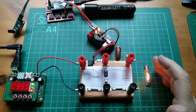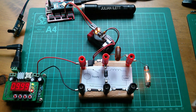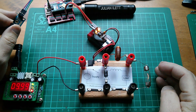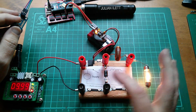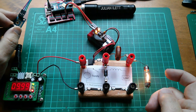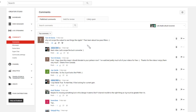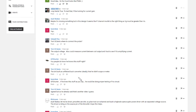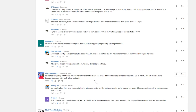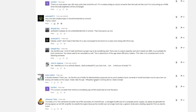Now, who was it that said in the last video that this wasn't really a buck converter — may not be a buck converter? It may just be simply that I'm doing pulse width modulation on the lamp and therefore varying its brightness. If we didn't have the inductor, didn't have the diode, and I just simply pulse width modulated the power from this power supply through to the lamp, yes, we'd have brightness control in much the same way. Comments from Jay Hurd: 'So far it just looks like PWM.' Lawrence L. and others: 'A scope would prove there's no bucking going on presently, just amplified PWM.' Alessandro Reva: 'If you remove the inductor and the diode...' So basically everyone said it probably isn't really doing much bucking — it's just PWM.